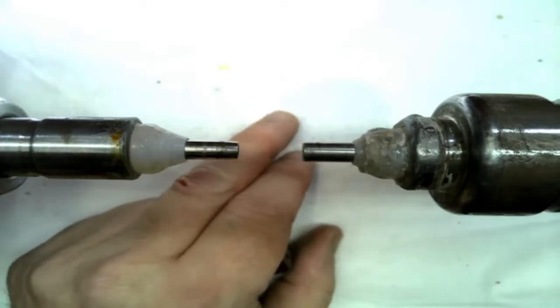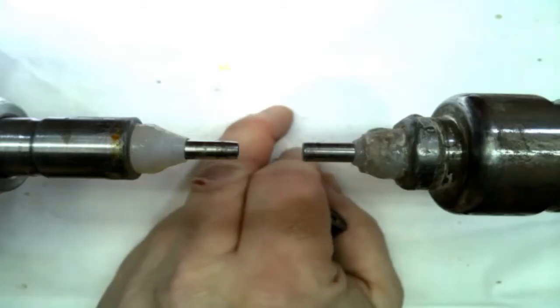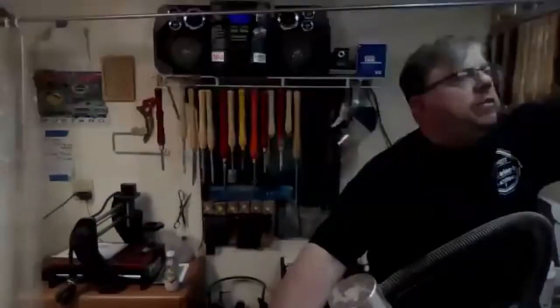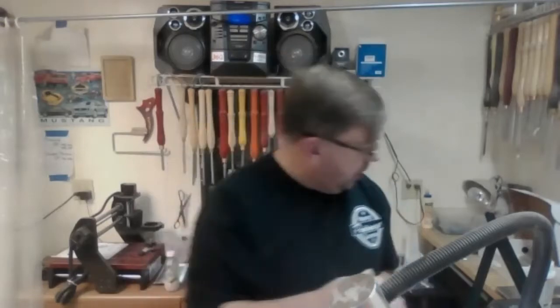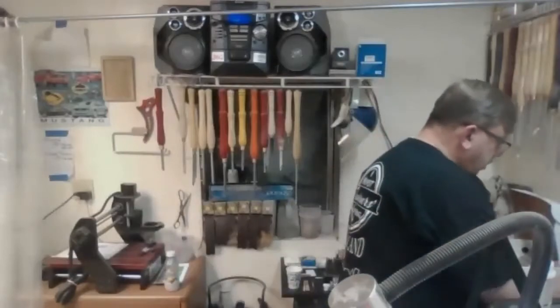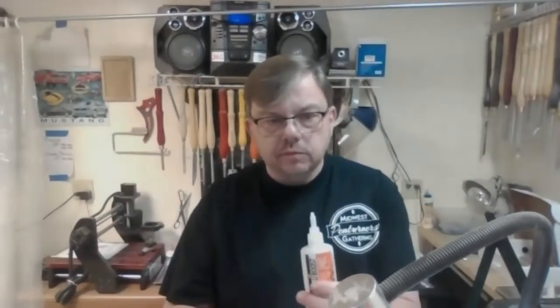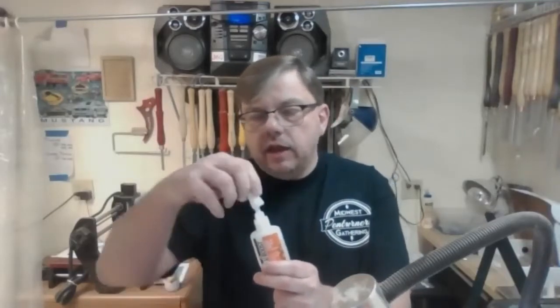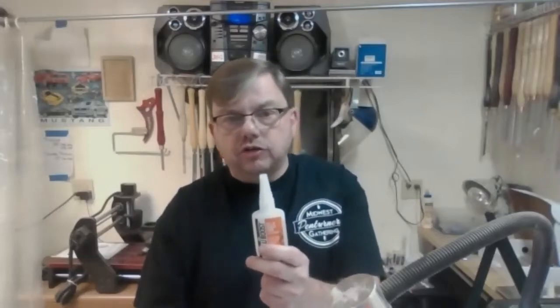As I said, my technique in summary, I start with the blue. I sand down and then I'll use maybe the first one or two of the micro mesh. And then I will put on the blue finish, one, maybe two coats. Typically always two coats gets me a nice leveling process. If I needed to knock it down, steel wool does it. So I'll use the steel wool and then I'll put two, possibly three coats of the fill and finish thin on top of it. And if I needed to do any kind of sanding in between, I would simply use the steel wool. Then I could automatically go to my micro mesh.